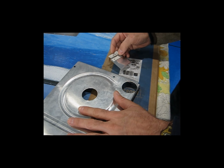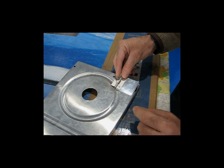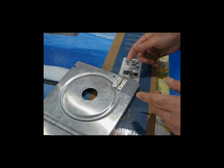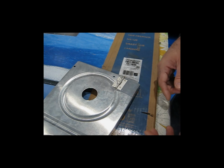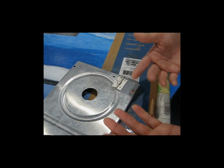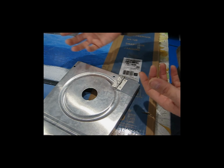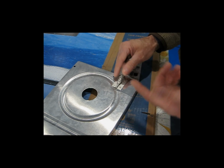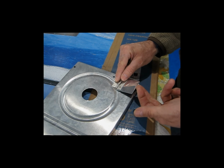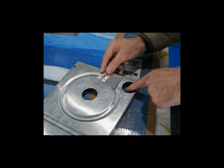And this is the second rib in the fuel tank, and it has as an option these little doors. If you're doing an inverted fuel system, you would have the flop tube as your fuel intake. That is also within this bay area. This basically allows fuel to flow from the rest of the tank into this bay where the fuel pickup is located. This door, in theory, prevents fuel from running back out through this hole here.